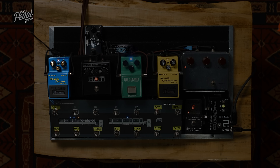So let's take some of these, shall we? Should we start with gain? Let's start with gain. So after the input stage, generally the input stage will be a buffer of some description, giving you a nice low impedance signal so that it's really stable, and then you can manipulate that in a number of different ways. And that will hit a gain stage. And what we'll do with that is we'll amplify.